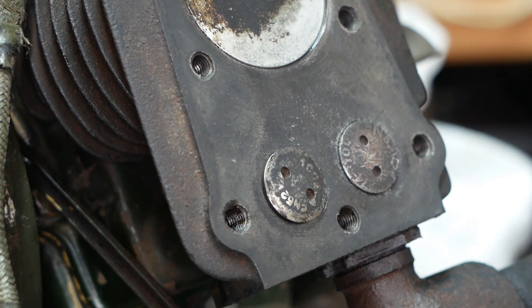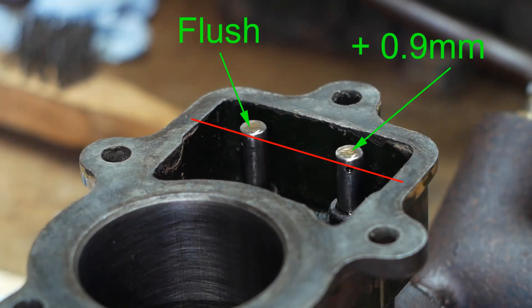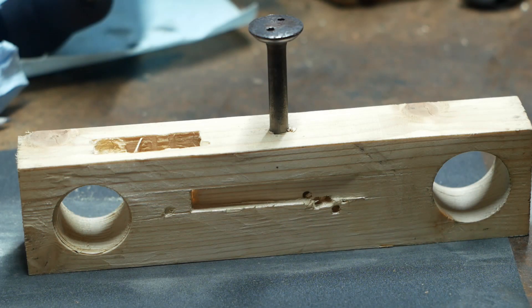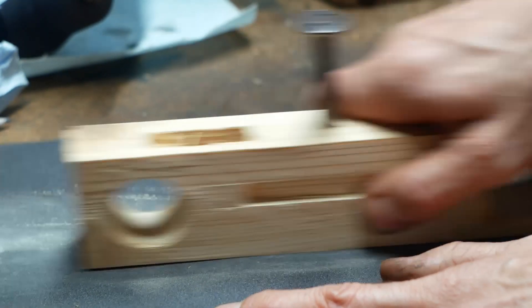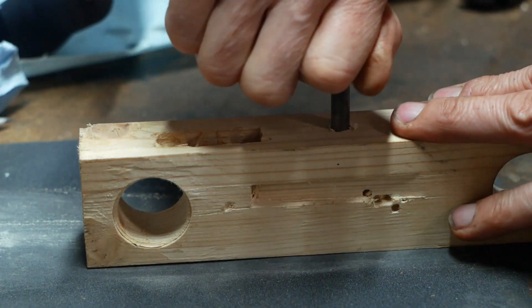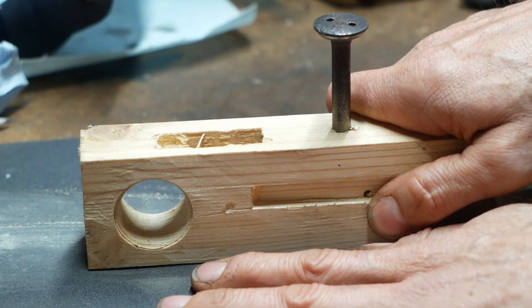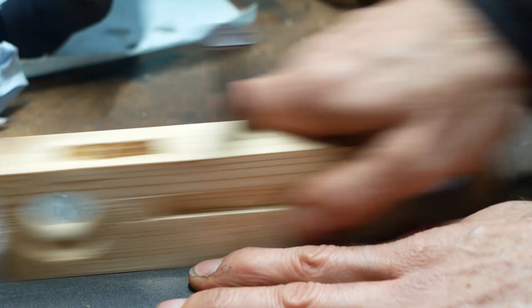However, this isn't too much of a problem — I've fixed a similar issue on my JAP engine in the past. I just need to take reference measurements to the lower face of the cylinder block and shorten the stem so that it matches the resting position of the inlet valve. I've already ground off the bulk of the material on the bench grinder, and now I'm just finishing it off on fine wet and dry paper, with the valve sitting in a block of wood to keep it square, and rotating it every so often to even out any discrepancies.